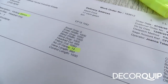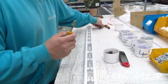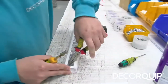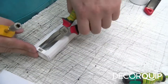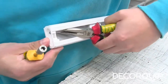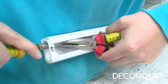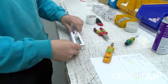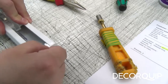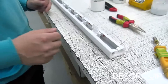Now you've got your Starlock tool. Using a Starlock washer, get your pliers and pinch the end of the tilt rod. I always turn it and hold it against my stomach, then secure it on. Just have a little check with the end cap that there's no play on it — that means they're secured exactly how you want it.